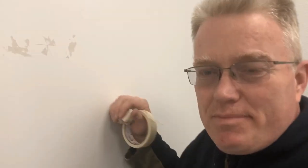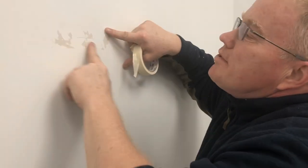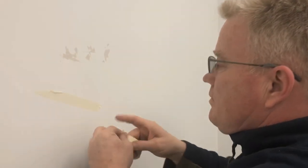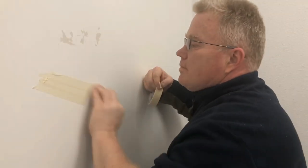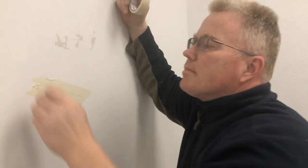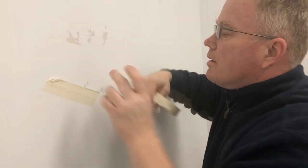Okay. This is what would happen to the wall by putting this mural on. So the wall needs to be prepped with a primer that seals the wall from the wall covering. Okay, that's your test. You just make an X. Now let's show you without making the X. Same scenario.